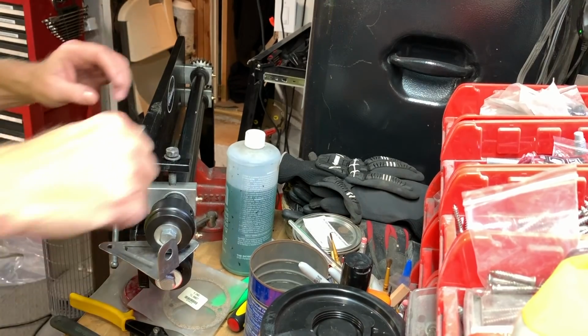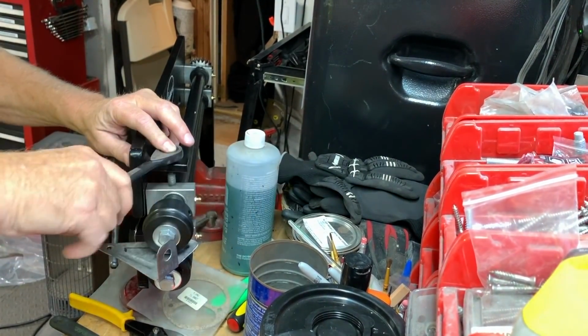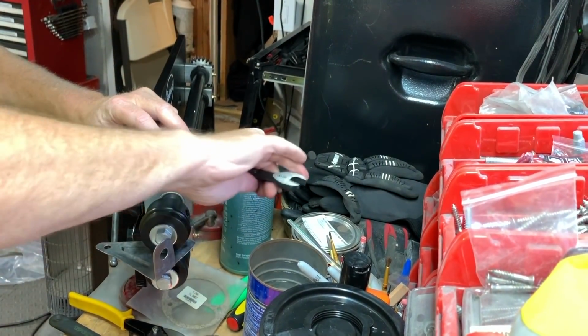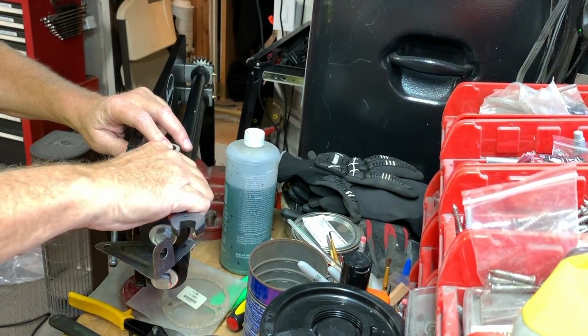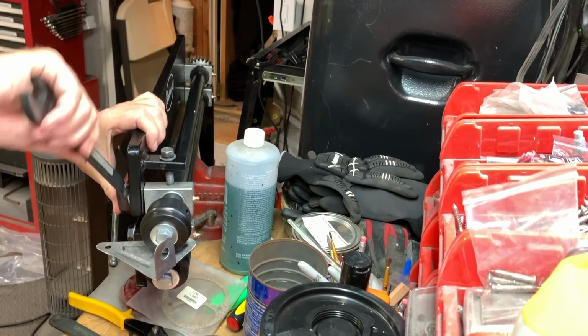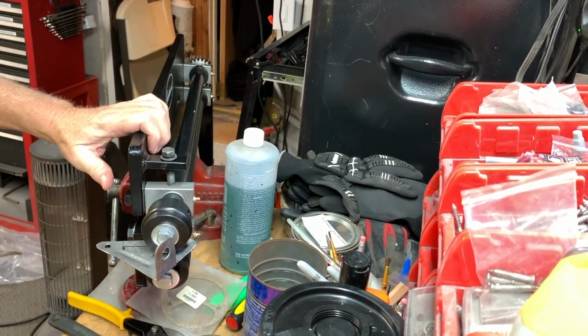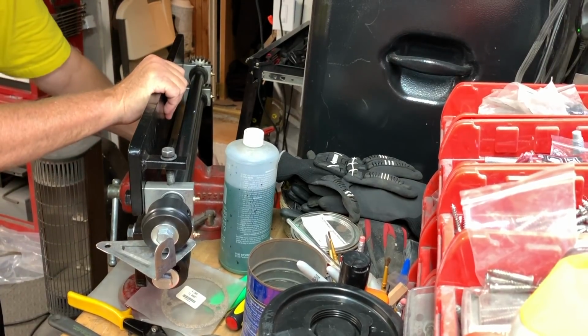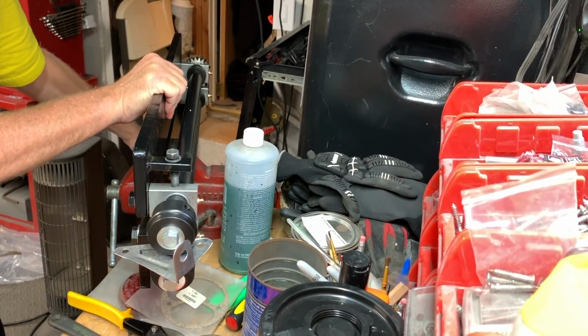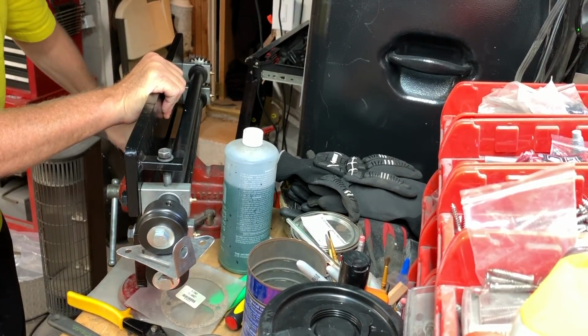Now the top die is cranked down to about half the depth of the bead. Yes, I already lost the handle that's supposed to do this, but a 3/8 inch bolt works just fine. Now the top die is locked into place. Roll forward once and then back.